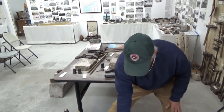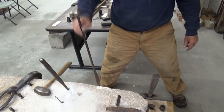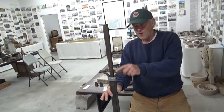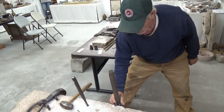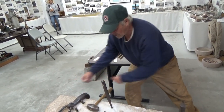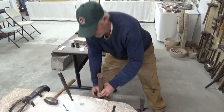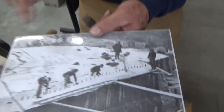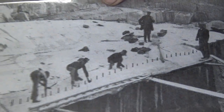Now we're pulling that steel out and taking the stone dust out with the dust spoon. This is now emptying those holes of stone dust and chips. Now we're putting in this tool — the foot wedge. This is a half-round with a taper in the middle, now dropping into that hole. Now we're striking that wedge and putting a strain on the grain. Every eight feet we have those foot wedges. Now we're drilling a smaller series of holes, putting a different size foot wedge in. All those foot wedges are put in, struck, and tension is put on grain.